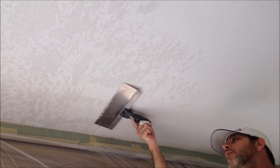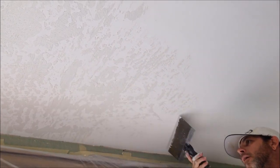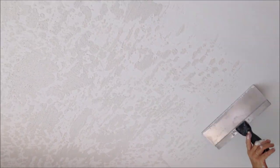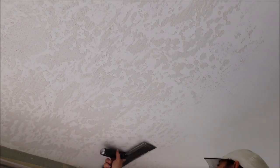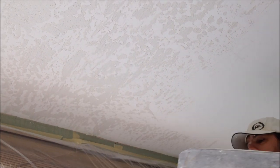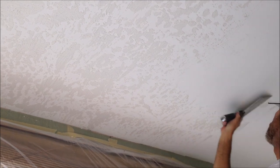I have all the tips at the end of this video, so stick around for that. I'll put a link in the description to the entire playlist of this ceiling repair. The ceiling was cracking at all the tape joints — it only had two tape joints, but they were completely cracking — so I removed all the paper tape and used a fiberglass mesh tape and a quick-setting joint compound to repair it.